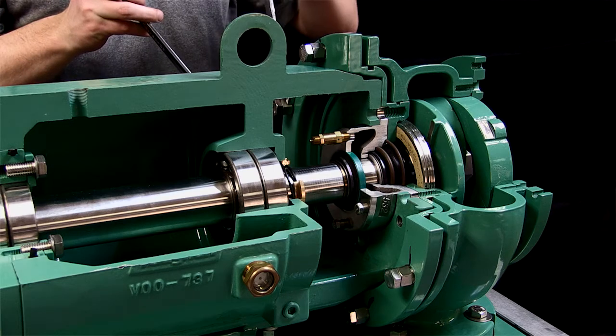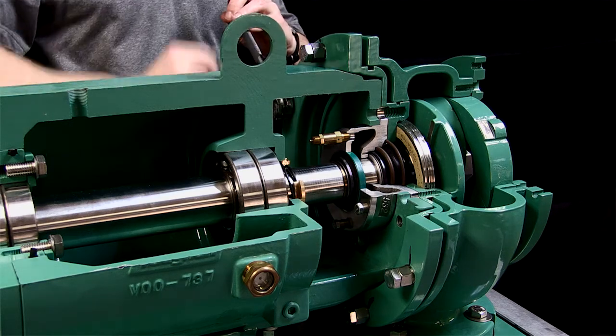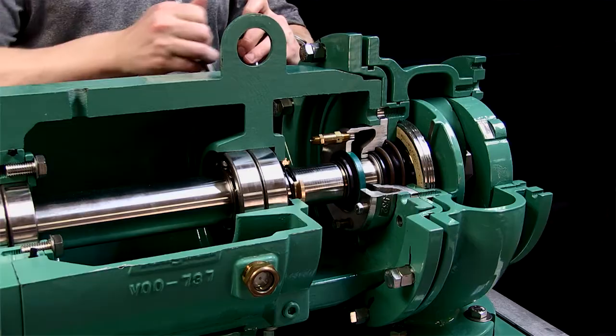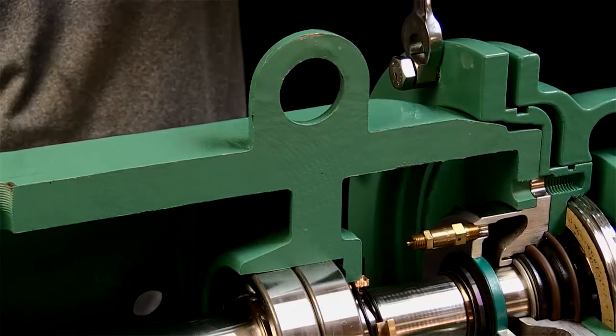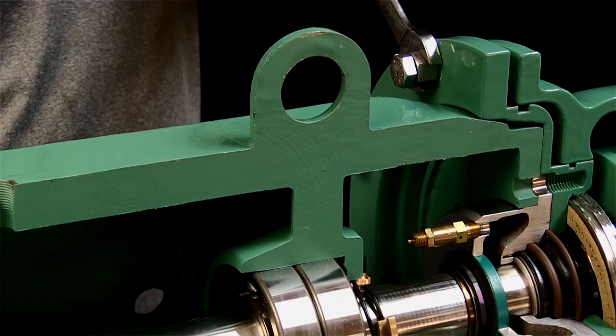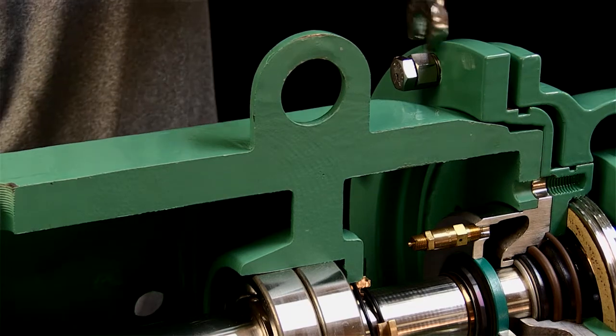Once the upper cutter adjustment is complete, the cutter gap on the front of the impeller can be adjusted. To make this adjustment, you will be moving the entire rotating assembly — including the impeller, backplate, bearing housing, and motor — in or out of the casing. To begin, loosen and back off each of the clamp bolts on the casing backplate, ensuring that the adjusting sleeves do not move with the bolts. Choose three approximately equally spaced sleeves that you will use to perform the adjustments. Back all the other adjusting sleeves away from the casing by turning them counterclockwise.